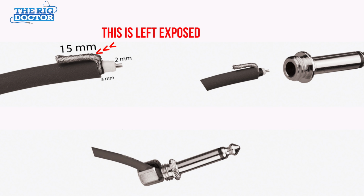But beyond that, the shield is also equally important to make sure is gas tight. And in all of these soldered connections that I've seen, all of the shields are very exposed and don't get the same attention that the center conductor does. They're just relying on the outer housing to put enough tension to hold the ground. But they're completely exposed to the elements. The shield is just as important because it is the return of the signal. And with that exposed to the elements and just as likely to oxidize as the center conductor, you're asking for a real problem. I've also noticed in the comments that, as a validation point for why solderless connections are good, people cite a famous artist who used a solderless cable to build a large rig, and that being the reason why it's a professional grade component.